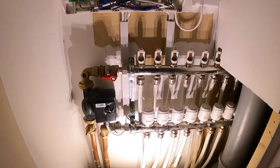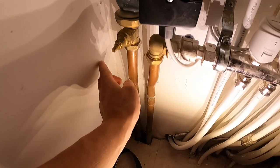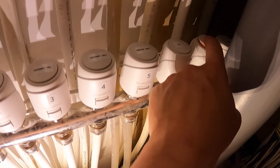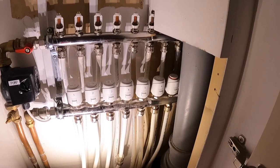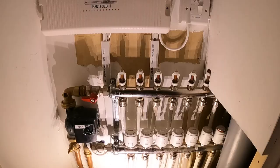Bit of a fail — the compressors have gone off and we're not getting the flow temperatures we need. It's just recirculating. The system's shut down because the flow temperature is too hot, as it's about 26°C outside today — not ideal for commissioning. But we know the zones: drawing room, entrance, entrance, entrance, drawing room, hall, utility, drawing room. The only things potentially swapped are the utility and that hallway. We'd simply swap the thermostats between those two rooms to switch the correct zones. This manifold is pretty much done — we'll button it up and come back tomorrow to do the same upstairs.